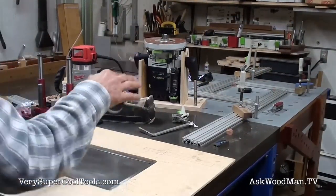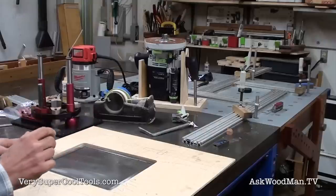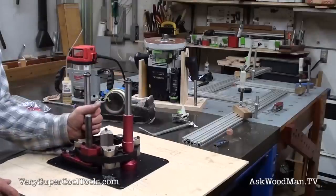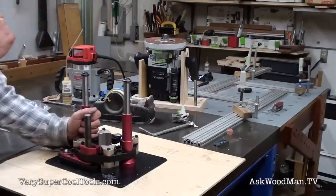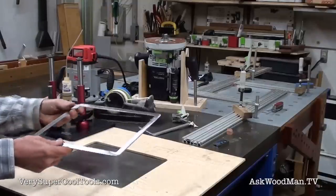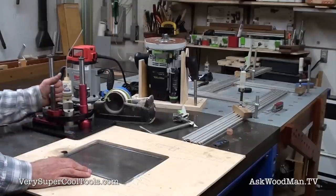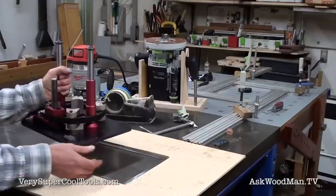I'm about ready to make this happen. I had to make a small adjustment — I got it almost the very first time, but it was just a little sloppier than I wanted. I really like this size right here. It's just enough that I can get this in here without damaging the laminate edge. I traced onto that piece of steel, and here's my — I'm calling it a tray. This is going to be the steel tray that the set screws are going to sit on. I've got all these set screw locations around here, and this is what's going to pin it to the bottom corner of the table.